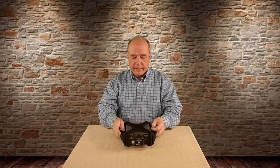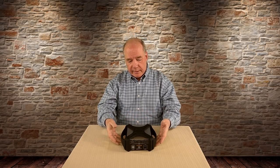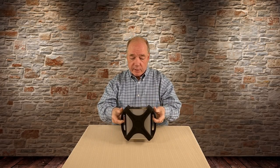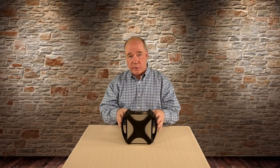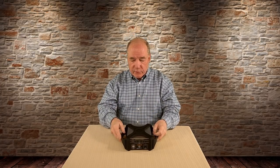It also has clearance on the bottom and top, so if I lay it down that way, that little eighth or quarter of an inch underneath means I've got clearance for air to get through for additional cooling. They've done a real good job with the cabinet — it's got aluminum top and bottom with heat fins built in to dissipate the heat, because this thing's going to get hot when you're charging and discharging it. Having that little extra clearance means it's up off the ground, I get airflow underneath, and the hot air can get out and cool air can get in. They've really thought of everything.